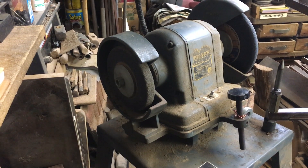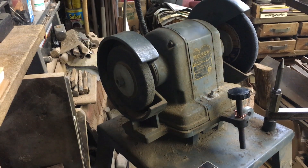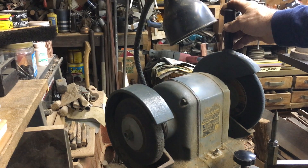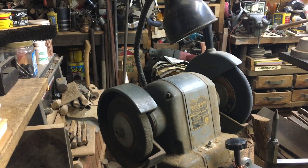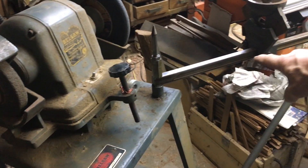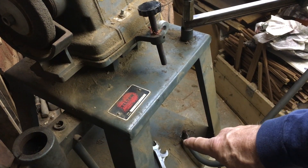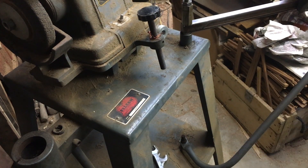It's essentially a bench grinder that tilts back and forth. It's got a stop on it. Here's your handle that you actually rock it forward into the saw blade with. You can see how the stop stops — it'll come all the way into your mark that you've got for the gullet radius, so you can get the shape of the teeth all exact, the exact depth. There's an apparatus with a pin and a long arm that drops back down underneath and holds itself. You tighten it up so it puts a little bit of pressure on it so it don't move back and forth.